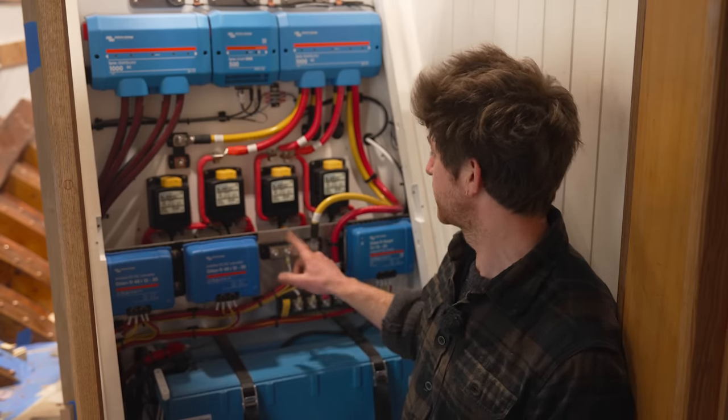And Joe, can you just tell us about why you chose to put the lever there? I chose to put the lever there because you're done charging and it's the morning and you want to use your engine to drive off the anchor. Because there's a high likelihood that the engine will stop in a position that doesn't allow you to engage the clutch. So with this button here, you can slowly roll the engine over using the electric motors until you can feel and then also see that you have real positive engagement, and boom.